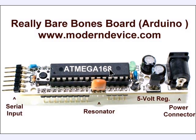If you look down here, these are push pins. It will plug directly into a prototyping board. Here we have a 5-volt on-board regulator, and here is our power connector. It can connect to a plug-in-the-wall power supply or whatever you have.